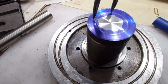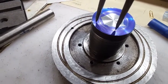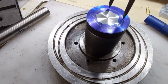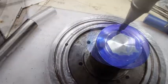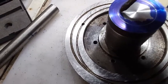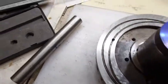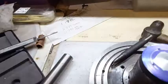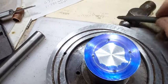There are different ways you can mark out — using a dividing head or whatever — but this is a simple and quick way. It doesn't have to be precise; it's just a matter of locating the holes so that they can be drilled and then counterbored. I'll center pop them all now and then give them a heavy center pop with a heavier punch. I've now deepened the center pops so as to give the drill a good start.